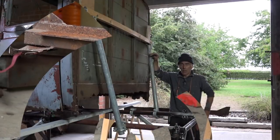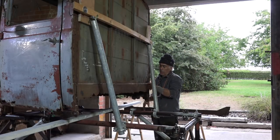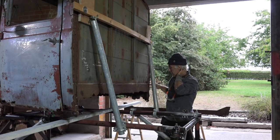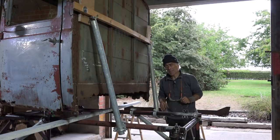It's about time to start cutting off the bottom part of the cabin because that is totally gone. I'm going to weld on a new plate — from the white line downwards it's about 170 millimeters. I already started cutting a little piece off but I'm going to cut the rest off now, and then we'll weld on a new plate and mount the part we prepared today.